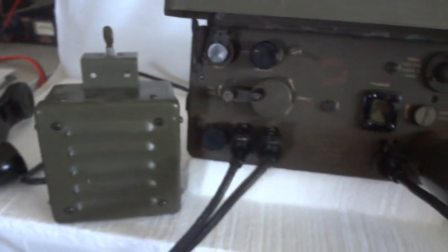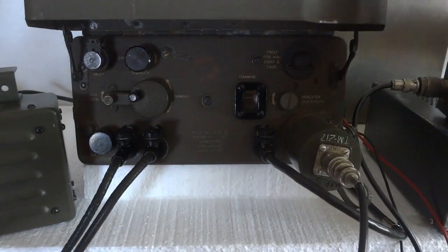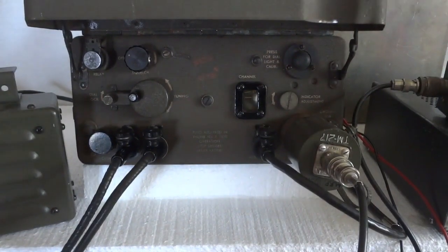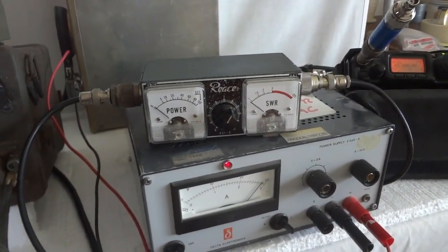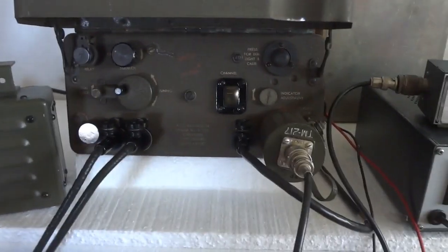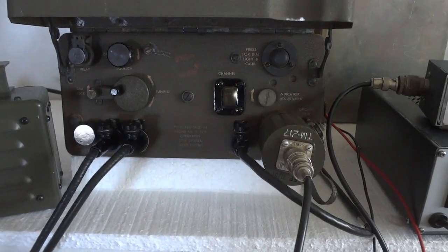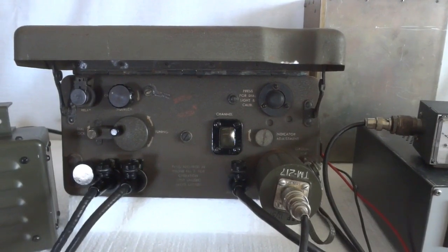The radio is obviously narrowband, so the volume isn't too high. The other issue is that this radio only gives about two milliwatt of audio output power, so don't expect miracles from a speaker. But as you can see, the setup is working. When I switch to my outside antenna, the noise increases a bit — the VSWR is slightly off but not bad. So this is just BC-1000 to the ham radio receiver, but we're now going to do a real point-to-point contact with a station about three to five miles away.